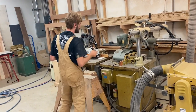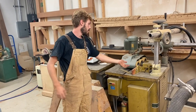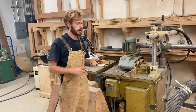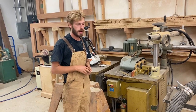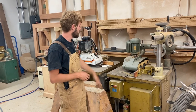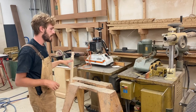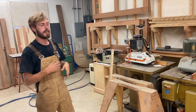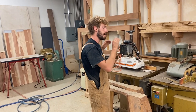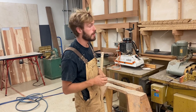Coming around here, we use shapers for a lot of things. When things come off the CNC, they have tabs. So this is a great way to put a profile on a piece of wood, like our lattice, rafters, lower T's on our rafters, and knock the little tabs off. Both of these shapers are set up for different purposes, meaning we don't have to spend time constantly readjusting. We just have these set up so we can roll them out and be ready to use them at any moment.